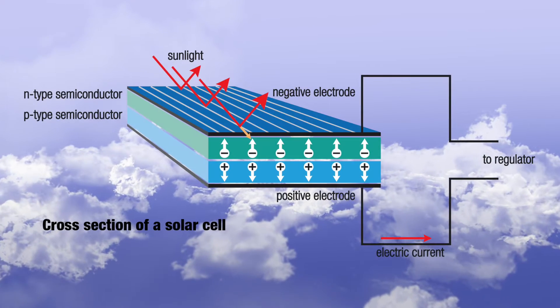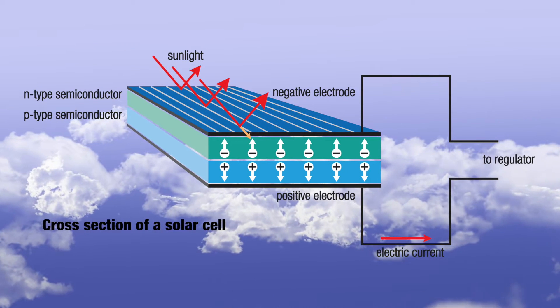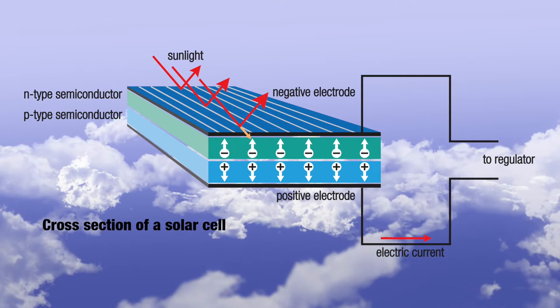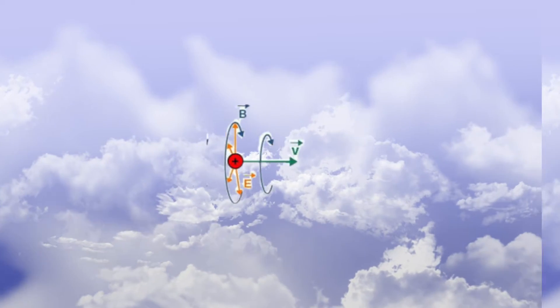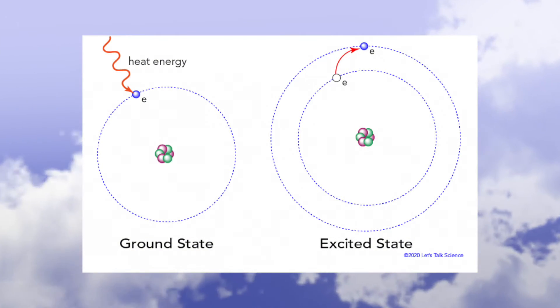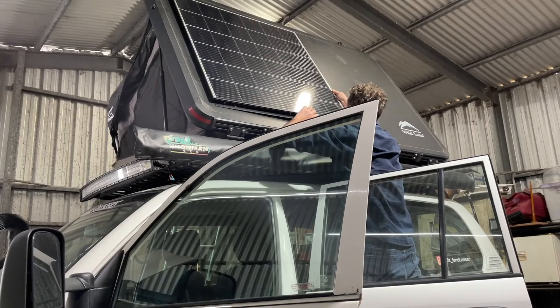A solar panel contains two layers of silicon: one that's basically missing an electron, and one that has an extra electron. When light hits this silicon it excites an electron and allows it to move from one layer to the other — a moving particle creates a charge. So why does heat affect this? It's because an electron can also be excited by heat instead of just light. On a hot day these electrons are already in an excited state at a higher energy level, so they don't have the potential to move when hit by light, which reduces the efficiency and output of the solar panel. The cooler you can keep them the better, because it doesn't take much for it to get really hot on top of that dark-coloured rooftop tent. If you can keep the panel up off the surface a little bit, it gets airflow, stays cooler, and is more efficient.